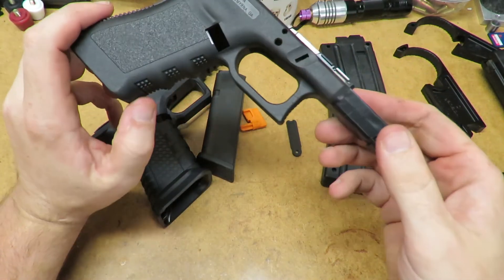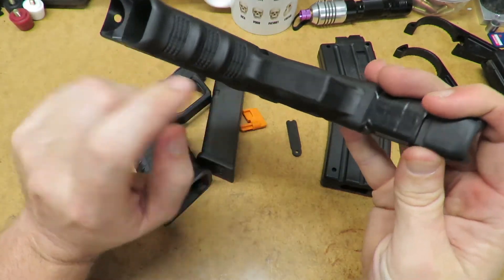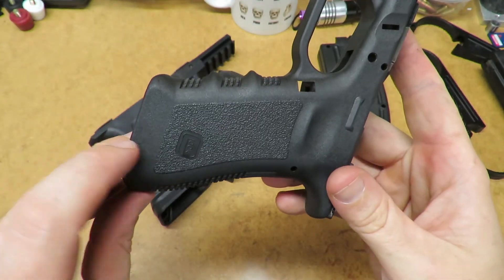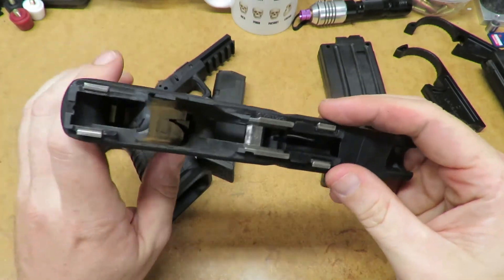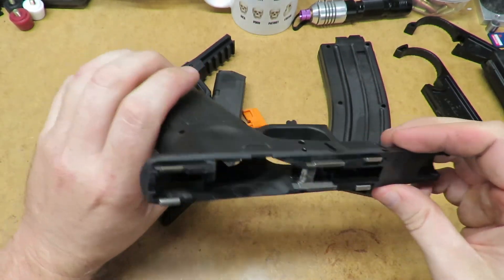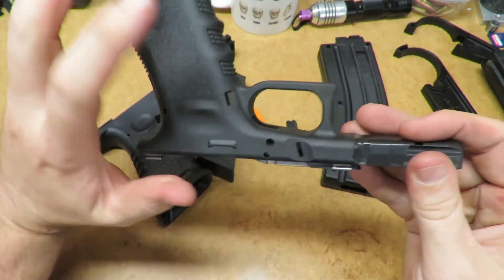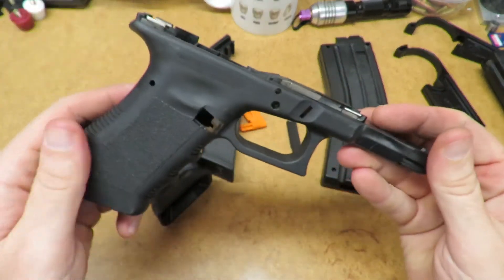The cheaper polymer parts are also nicely flexible. This Glock frame is done just like any other — the difference is quality of work. It has a seam up the middle. The Glock logo, being smooth and squared, is an insert on the mold, and there's also a part of the mold that holds the metal rails in place when they inject the plastic. The push pin marks are really hard to find on these, though there is one obvious one down here.